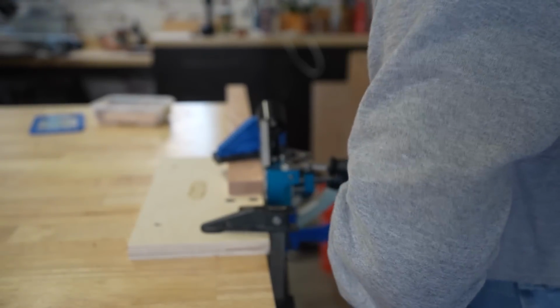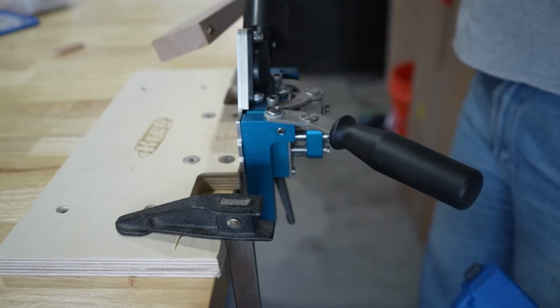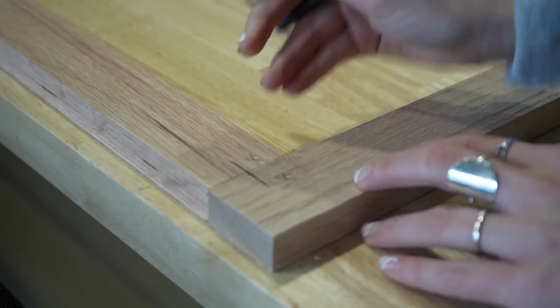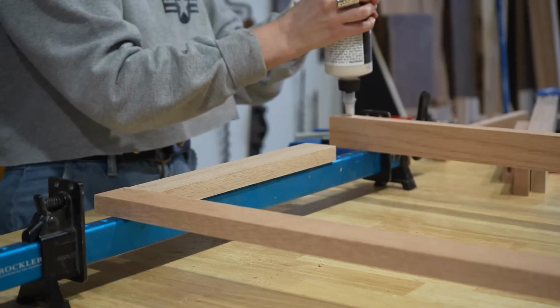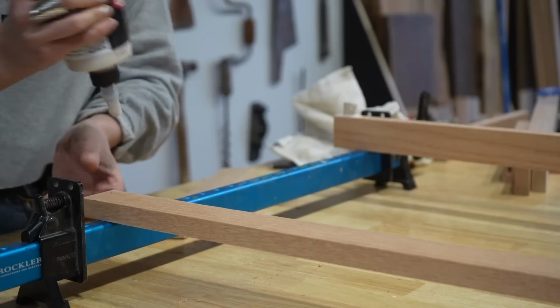And since we're really only making door frames and then attaching slats to the front here, this is a really simple way to do this by hiding all of the joinery on the inside of the rails and the stiles and then gluing things to the front later. If you wanted to add a panel at this point and you still are only using 3 tools, you might want to just cut some plywood and attach it using pocket hole screws to the inside of the doors.